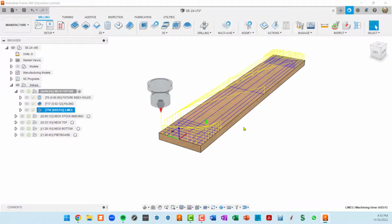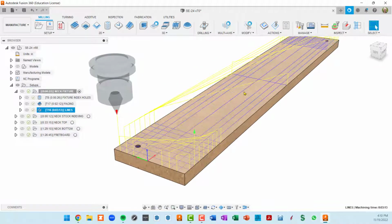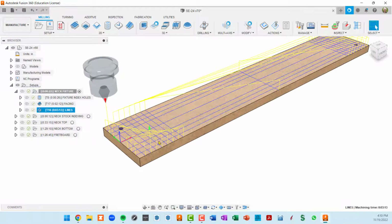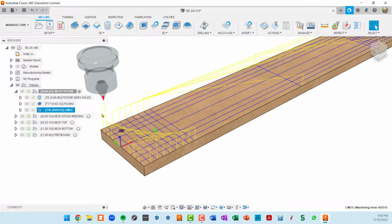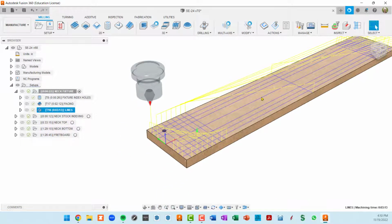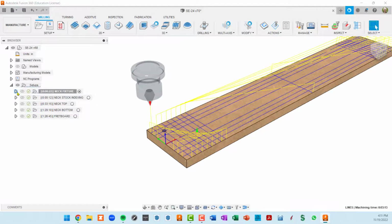And then the last thing I'm doing is a set of lines. I've got center lines, horizontal and vertical, and then I come in from each side and draw little 1/2-inch lines, well, I shouldn't say draw, they're actually cut with a V-bit, just a little bit down into the MDF. That way I can by sight center a piece on this fixture, whether it's a neck or a fretboard. Okay, so that's the neck fixture.